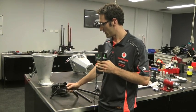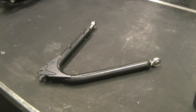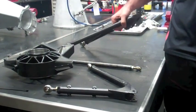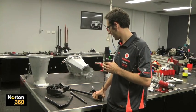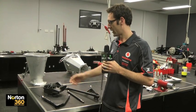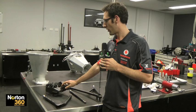These are our top wishbones — same thing: a bent steel tube, laser cut plates welded together, and a steering arm, also the lower control arm. We machine bits of these and weld them together. Roughly, they take about a day to make a lower control arm. It takes almost a week to make a front upright because they're quite labour intensive, but strong.